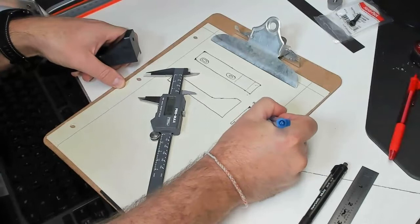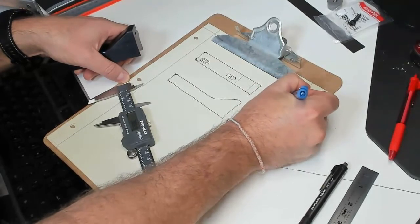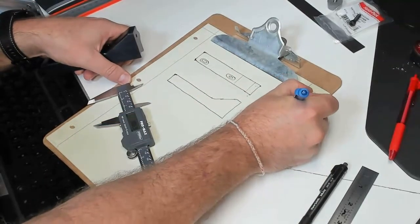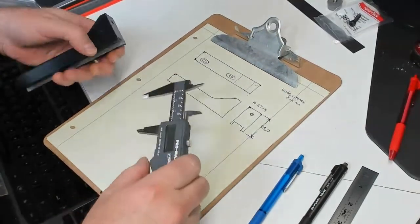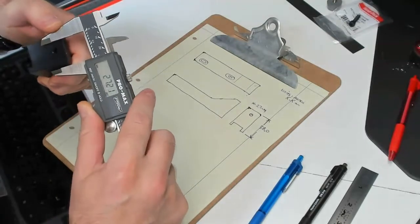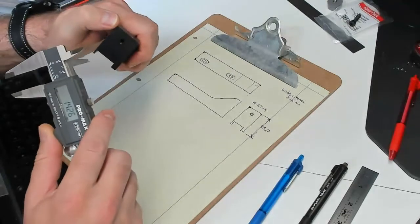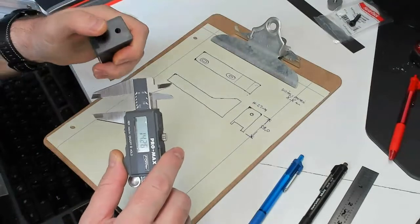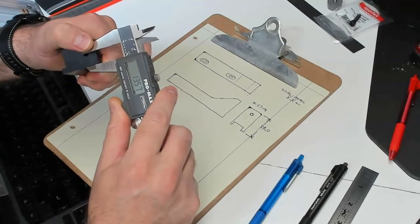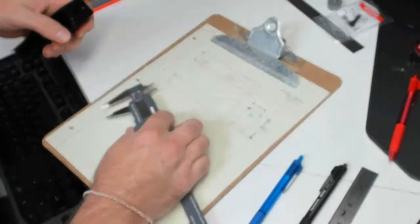You can always put your decimal places just to keep it consistent. I'll remind myself: units — metric, X.X millimeter. Now let's locate that hole. I'm going to assume just by looking at it that it's right in the center. So 27 divided by 2 — I should be looking at 13.5, right around the center. And that's looking correct: 13.47, round off to 13.5.